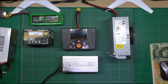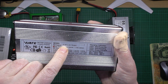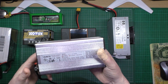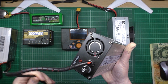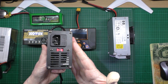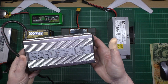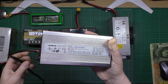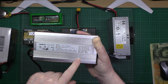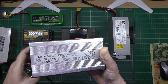This one here is a 75.6 volt two-and-a-half amp charger which runs directly off the mains. I've got another one which is a four amp charger but I haven't got it with me. At two and a half amps, 75.6 volts, that's 189 watts maximum output. In my previous video when I took it apart, it says 240 watts on the board somewhere — but it just isn't.